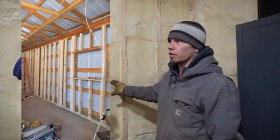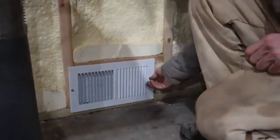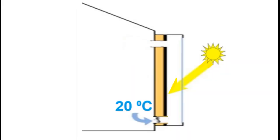This is the thermal insulation on the inside of those sheets, and these are the connections of the room with those holes to provide air movement when fans direct the air of the room here, where the air is heated by solar radiation and returns to the room.